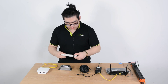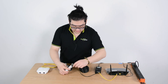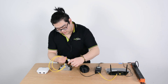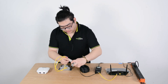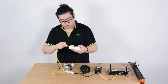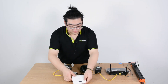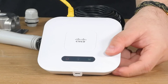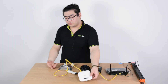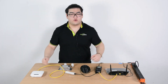We're going to screw off the waterproof glands and insert the PoE signal into the input port. At the output port, connect an Ethernet cable. That Ethernet cable then connects to our PoE wireless access point — no power cord needed. Once pushed in, you can see power going through it and the data warming up. Shortly it will become a fully usable wireless access point, and we can get Wi-Fi outside the house, far away from our router, and still have wireless network access.